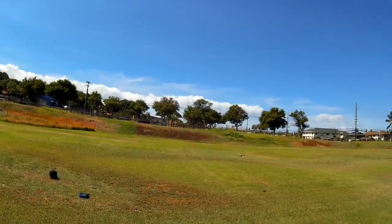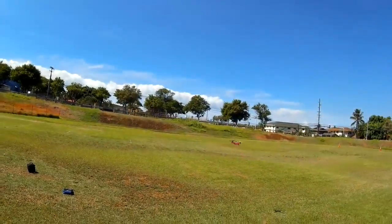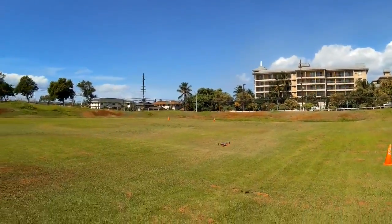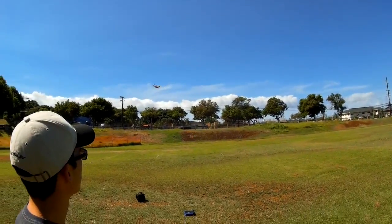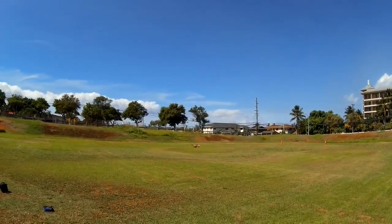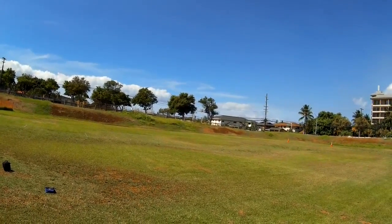If I were to set up the rates on the stick to use half of the stick space for just that narrow hover band, you'd have a lot more control of the rotor speed at hover — and I haven't tuned that yet. I also haven't balanced those props, but they seem pretty good. My main reason for balancing props is to keep vibration out of the frame so you don't get jello in the video.